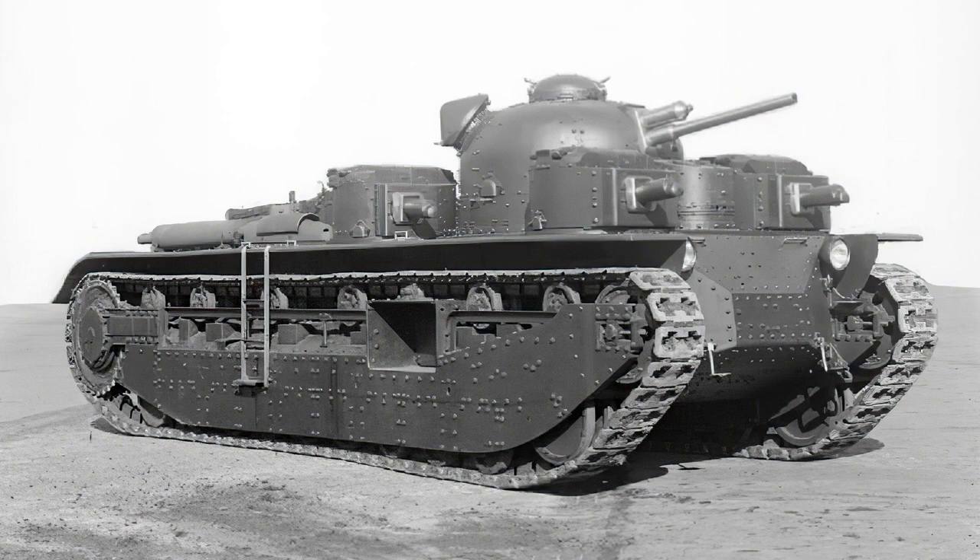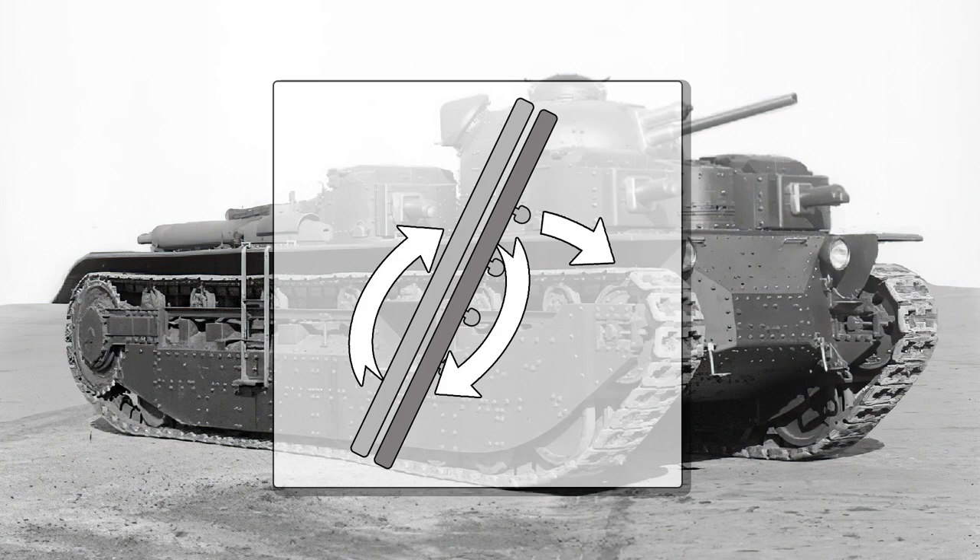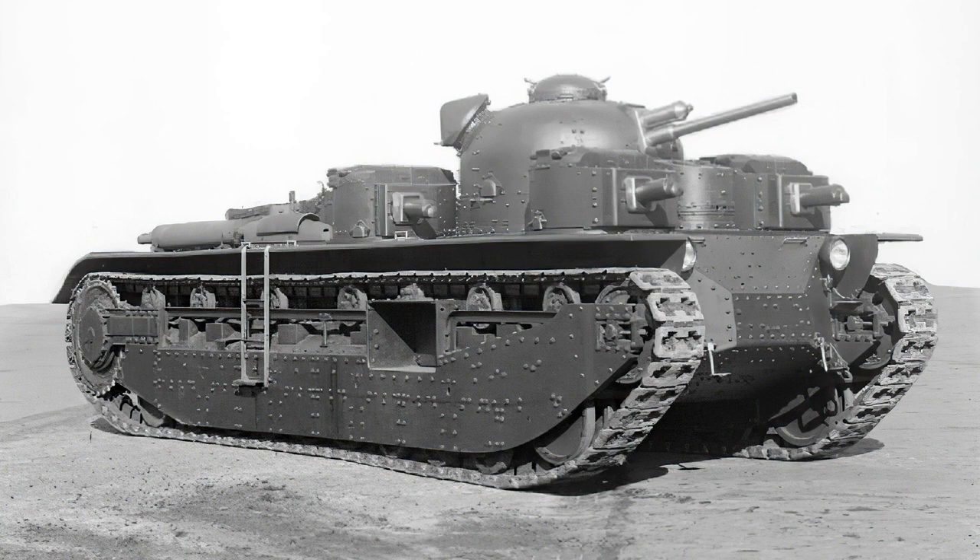The hardened plate was then cooled and lined up with a corresponding softer endoskeleton of ductile material, and the two parts were riveted or bolted together. This would help break up any armor-piercing shot when struck horizontally, and the soft inner side would absorb the energy in any shot and prevent heavy spalling. But it was not a perfect solution — firstly, it could lead to the rivets or bolts breaking off inside the vehicle due to the imposing stresses snapping the heads, although this was not as common as people like to believe.